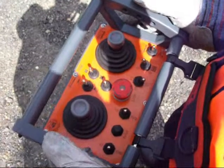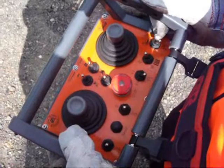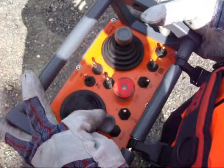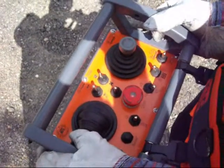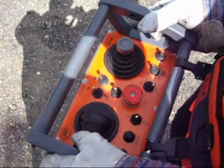Going to do the tipping operation. To achieve this you need to select your power arm, press reset, and bring your arm out to 90 degrees. It needs to swing out to 90 degrees to avoid hose damage caused by twisting when the lid is open.